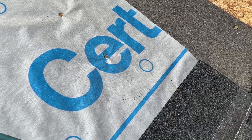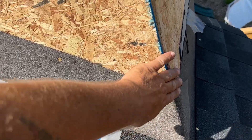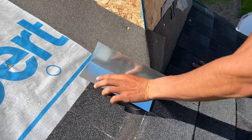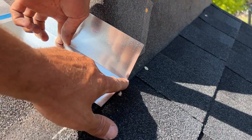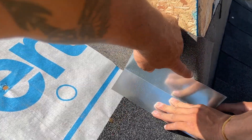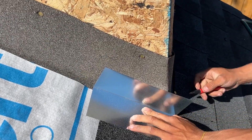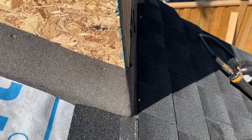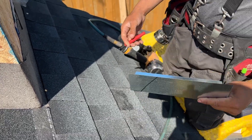Our first step flashing is going to sit at the corner. We're gonna shingle up and just past the front wall so the shingle is sitting past here. We're gonna cut a new one. So we're gonna do our first step flashing — set it in, and this point here needs to be an inch past this wall. Bring it past and then we're gonna make a mark up here where this hits. What we're gonna cut is from this point down to the point of the step flashing.